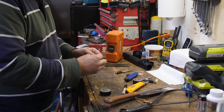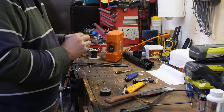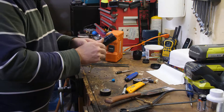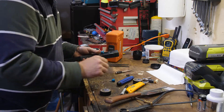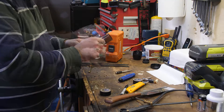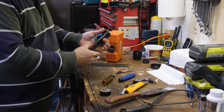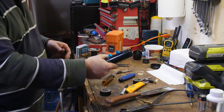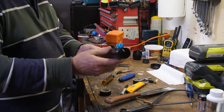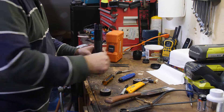Number six fine thread — those are just going to go straight through the center of those now. I should be able to thread those straight into the holes I just tapped. These bolts are a little long, I'm going to end up having to cut them off. These are a nice distance because you've got the knurled part of the handle that you're going to hold onto, and with your thumb you can basically adjust the intensity of the saber. When those are sticking out inside the hole, we're going to cut those off so they don't interfere with the saber emitter.